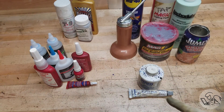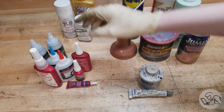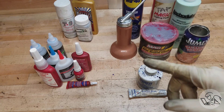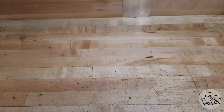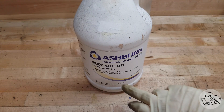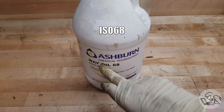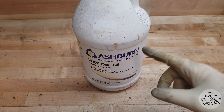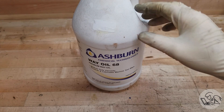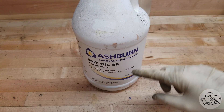Here are the primary contents of that box, broken down into major categories: lubricants, finishes, adhesives, and markup. We'll start with lubricants, and the most important lubricant in the machine shop is way oil, also called ISO 68 oil. If you're a hobbyist starting out and you buy exactly one thing in the fluids department, make it this stuff.